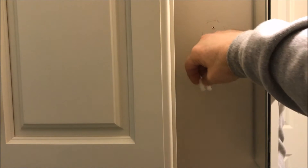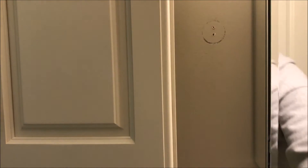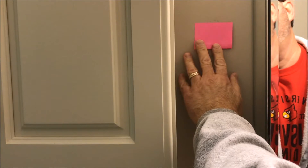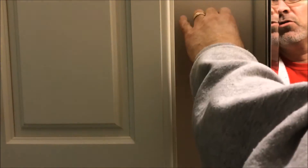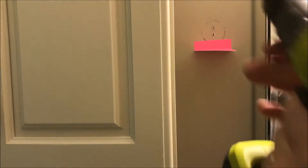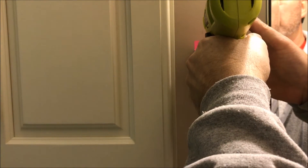They will require me to enlarge these holes a tiny bit, but that's not a problem. Let me show you a little trick I learned a while back: if you take a post-it note and put it right below where you're going to drill into a wall, crease it so it forms a little ledge — that should catch a good amount of the dust from the drill bit.